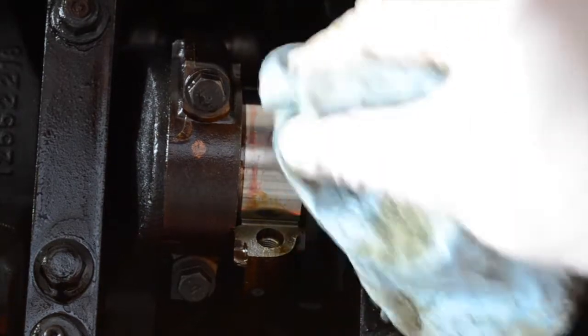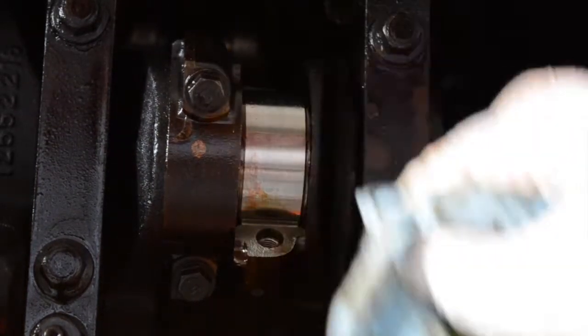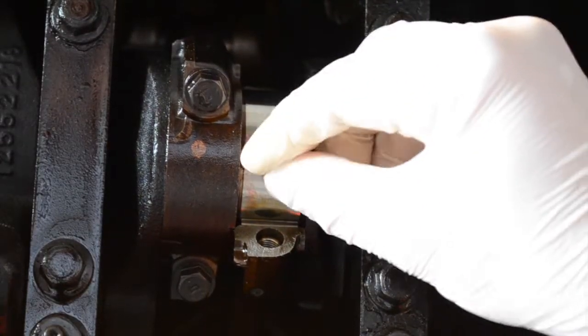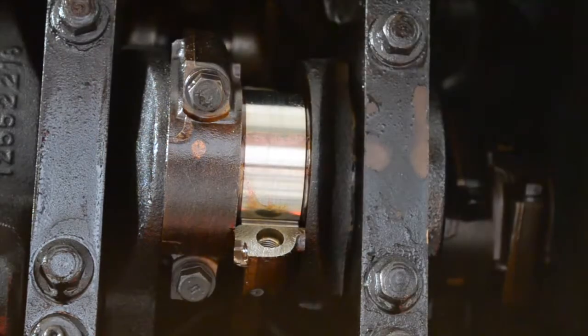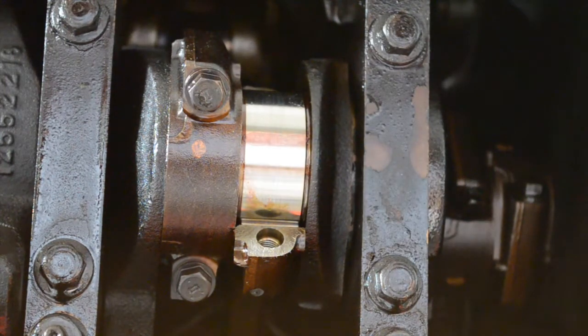Another thing you want to do is wipe that plastic gauge off. They say you can leave it and it won't cause any problems, but I'm going to get that out of there before I put it back together, just for peace of mind. And I'm going to put a little bit of assembly lube on there as well before I snap it back together. Make sure you check out the rest of my channel and follow along when I'm in the process of putting this motor in the S10. Thank you for watching.